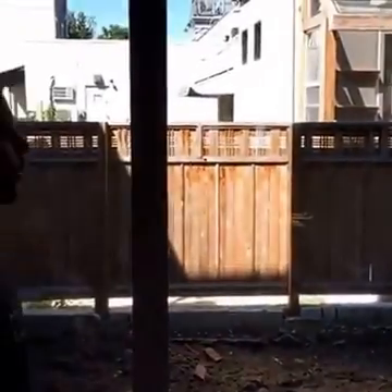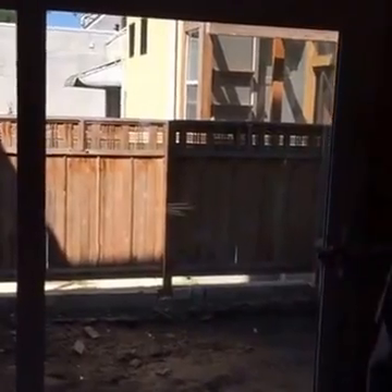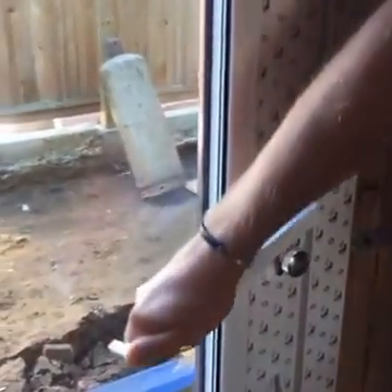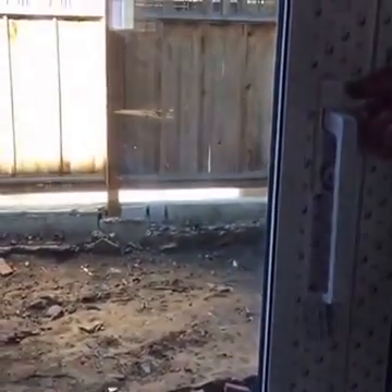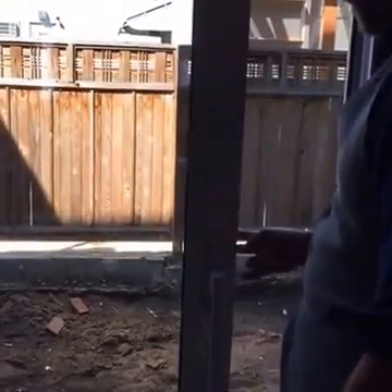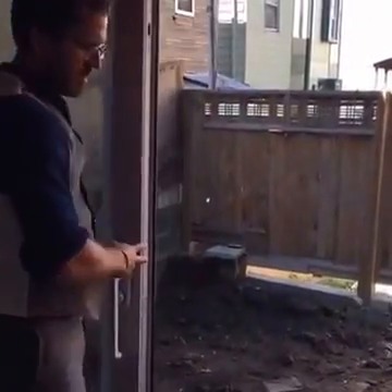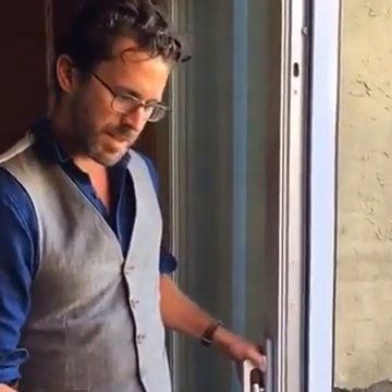What's the maximum size the glass can be? We can go about 100 square feet in just glass, without any sort of spacers or reinforcements. We've got all the same glazing — the triple pane. What's really cool is the hardware and how it functions. These are called lift and slide hardware. This locks and unlocks the door. When you turn the handle down, you'll notice the whole door kind of lifts up a couple millimeters and is ready to open. Once it's open, it only takes about five pounds of pressure to move this roughly 500-pound door.